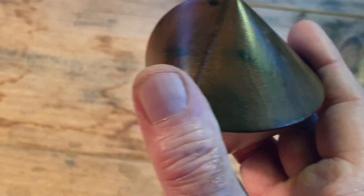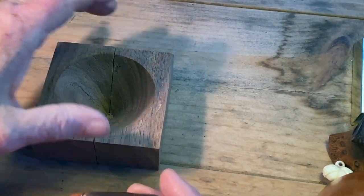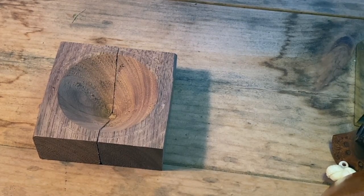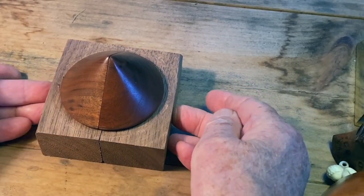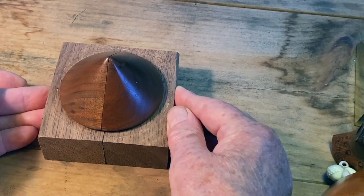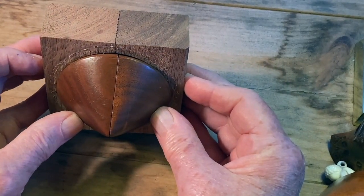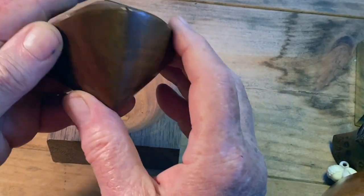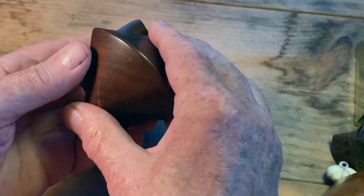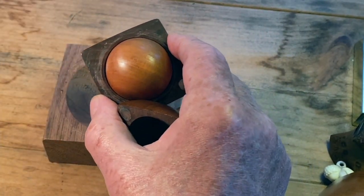Here's the thing that I learned and realized about these. This is a chuck that you would use to make this — it's a cone shape, a double cone. It's inside the chuck. You can hold these two blocks in your scroll chuck perfectly well. Hot glue this thing in here and it'll stay while you turn this end. I make them like normally other people make boxes — I make the inside first, and then the outside.